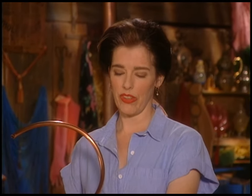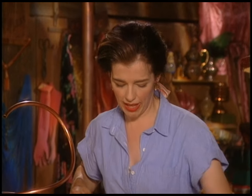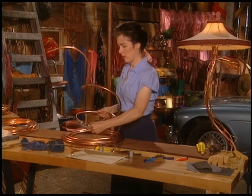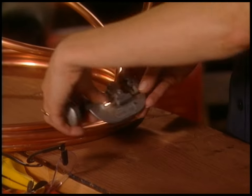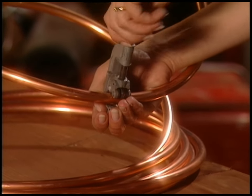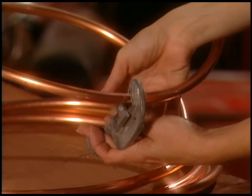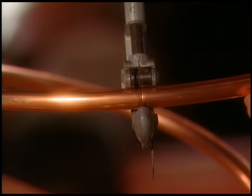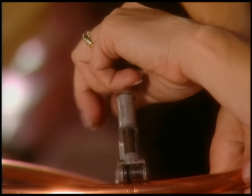Once I've got about as much as I want to work with, I'm going to cut it off. You want to use a pipe cutter — it's a great tool, costs about four bucks. Set the pipe in that little groove, the blade comes down as you tighten it, scoring the pipe. Don't pinch it too tightly at first or you'll squash it out of round and it can't cut. Each time you come up to the starting position, tighten the pincher a quarter turn, and the score gets deeper and deeper until it's all the way through.